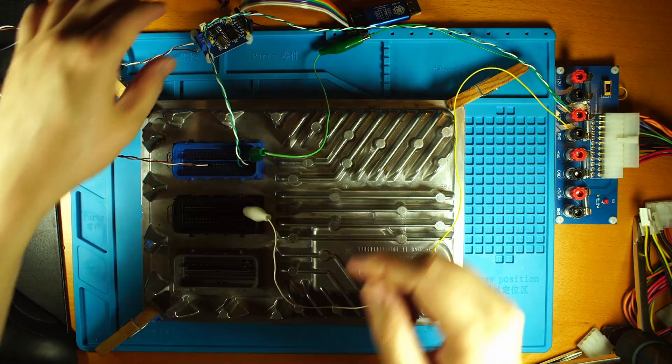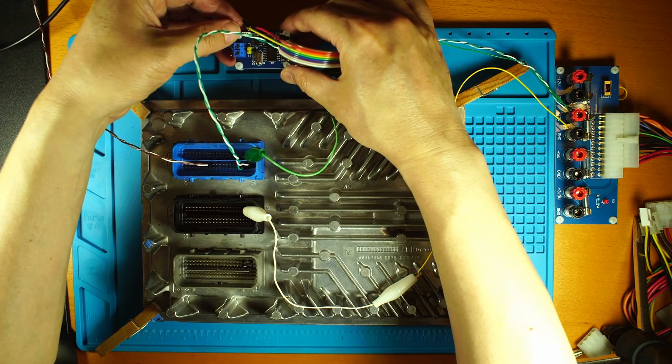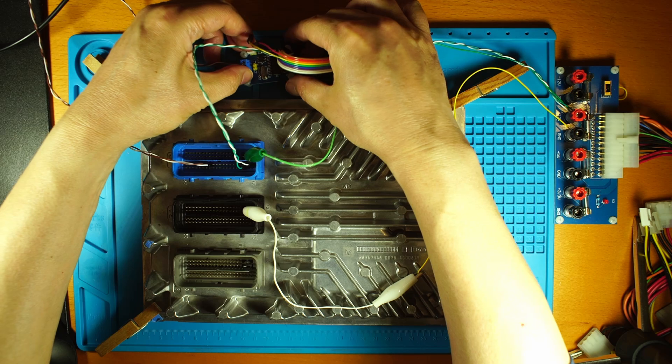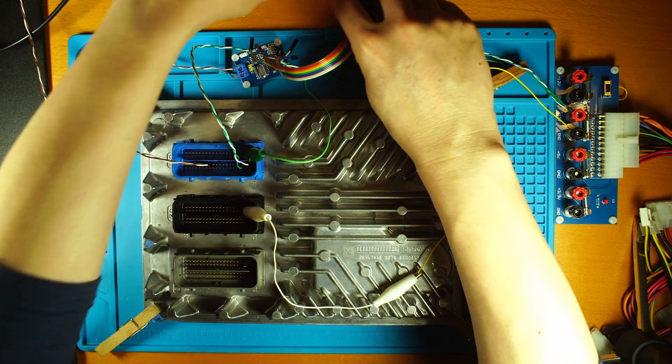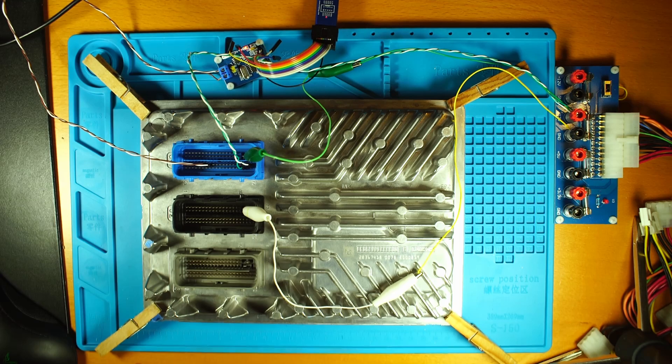This is how this is connected. The two wires go to this module. You need to have the jumper here to properly terminate the CAN bus, and then we can plug in this one and go to the USB hub.